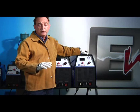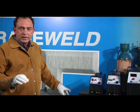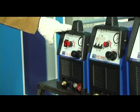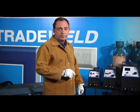For clean cuts, you can take 5mm off each size. When cutting stainless steel with any of these machines, you can knock off 30% of the plate thickness. The Cut 40 is a bigger selling plasma. For the demonstration, we'll be using the Cut 40.